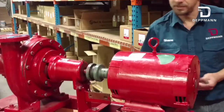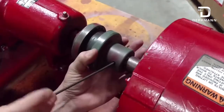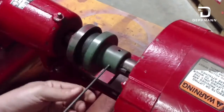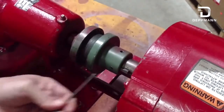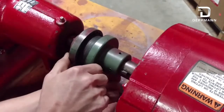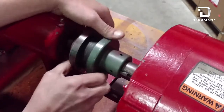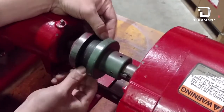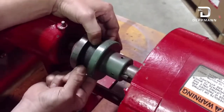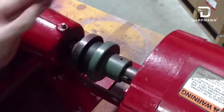So my alignment is complete. I'm going to properly space this coupler. The reason for that is these will swell once they get running and get warm. So you just want to back it off a touch — you don't want to squeeze these all the way together. You want to have room so these can move back and forth and breathe.